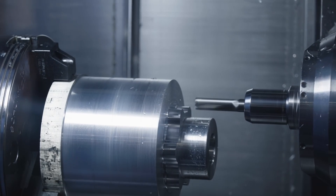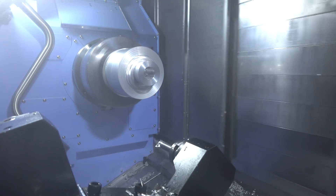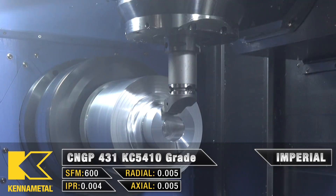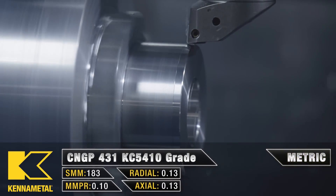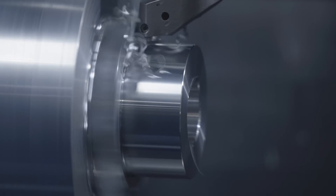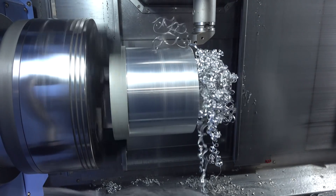I've locked the B-axis so the tool is locked to the side position. The next tool coming up, we're going to start doing some finish passes — finishing the face of the part and turning across the OD. This tool is a CNMG 431 and it's in the upper spindle because I'm going to be using it on the second op as well. It's running at 600 SFM with a feed rate of 4 thousandths per revolution. Because it's in the upper spindle it can flip its orientation for the second op, so I don't need to keep two separate finishers. For finishing, the insert grade I'm using is KC5410 from Kennametal.